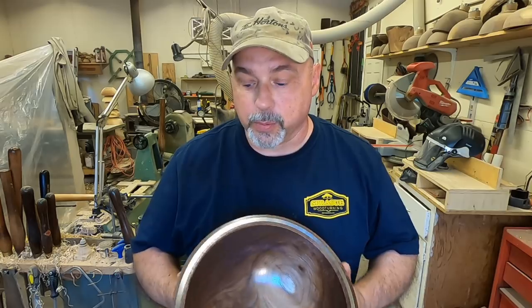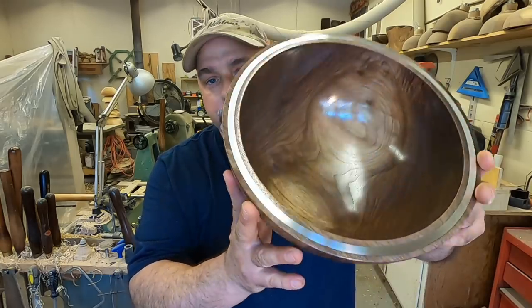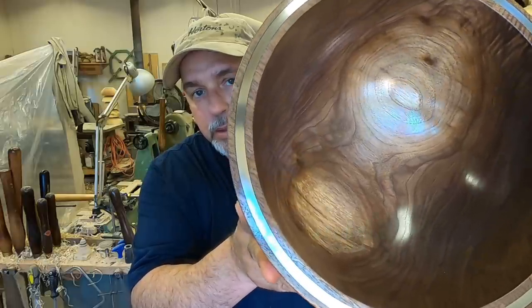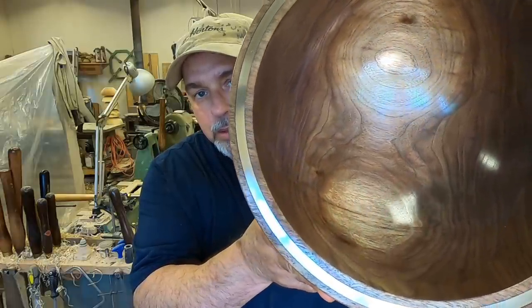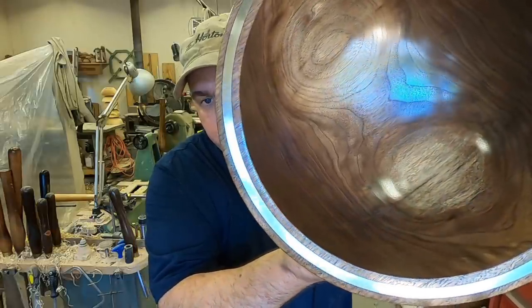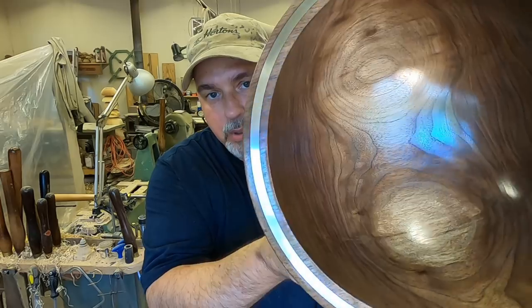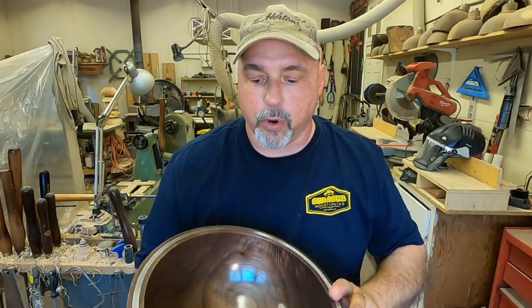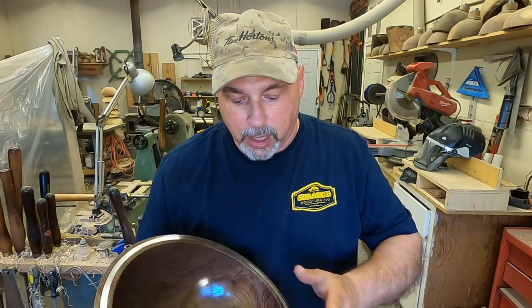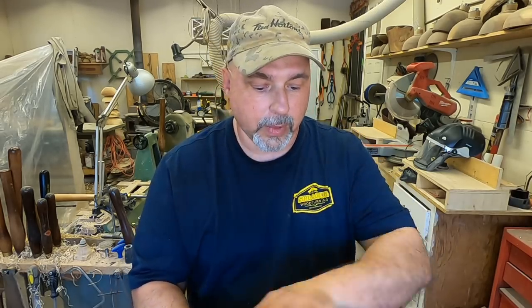Well, that's it for this week's project. Give you a last couple of looks at this. Not easy to film because it's so shiny. But yeah, we went to 400 grit on this and then 4-0 steel wool, and then 3 coats of finish.